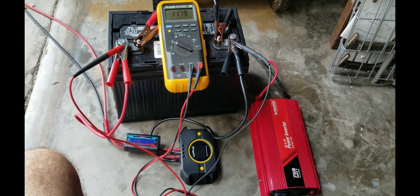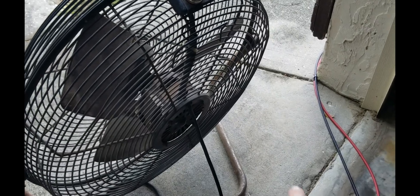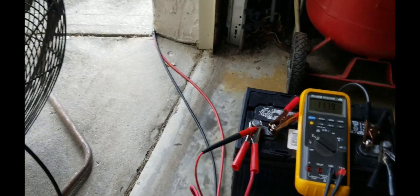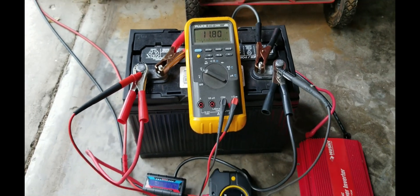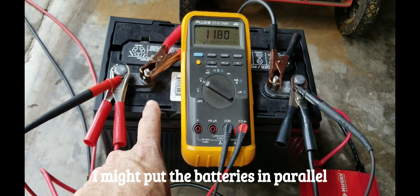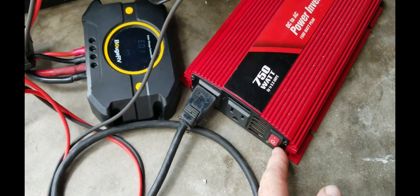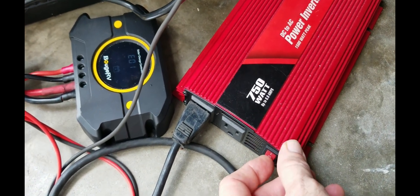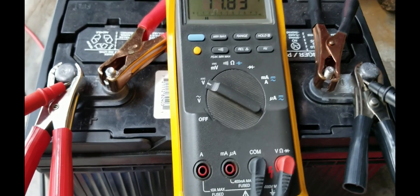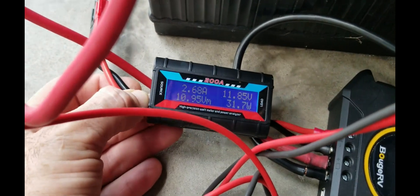What I've learned: I believe I can use this fan next Saturday and keep everybody underneath the canopy cool, because it's going to be probably mid-90s. I should be able to do it with two batteries, or even one, but I'm going to take two just in case. I have another lead-acid deep-cycle battery I'll bring. The battery is at 11.8 volts with the fan off but the inverter still on. Turning off the load, we're up to 11.83 and still at 31 watts because the sun is still covered by clouds.